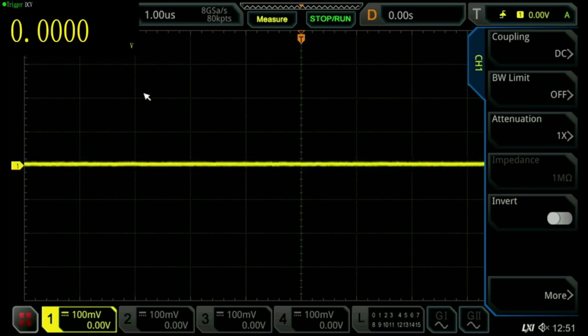And the oscilloscope probe, as you saw, is connected via that little springy thingy, which means we don't have a ground loop there to pick up noise that we would otherwise see and think it might come from the power supply, but it does not. So the bandwidth of the probe is 35 megahertz.